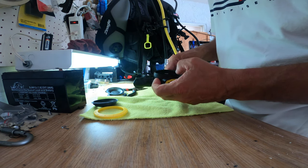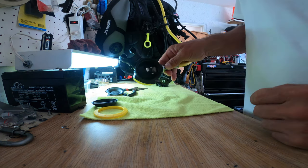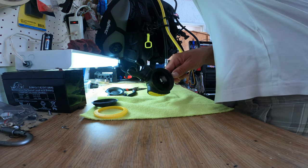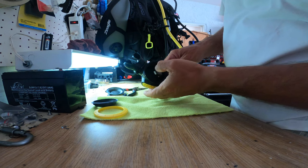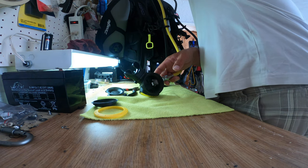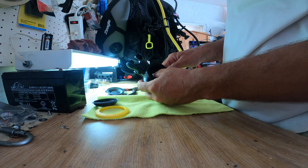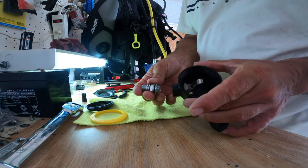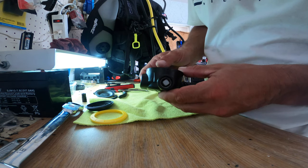And here's the regulator itself - it looks like this inside, spring-loaded, and that's how it works. With air on, the valve is right there. Taking this apart nice and easy - it's actually screwed in at both ends. That's where the air comes through, and where I have my leak is actually on this little vent right here.